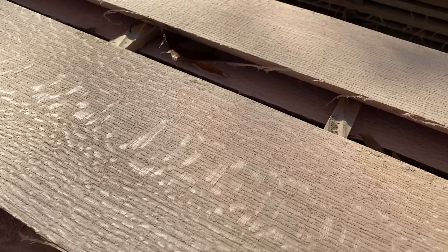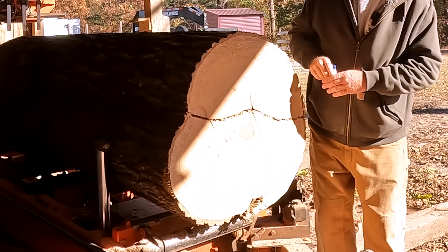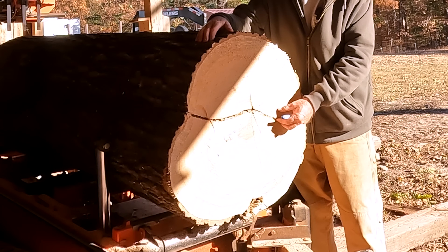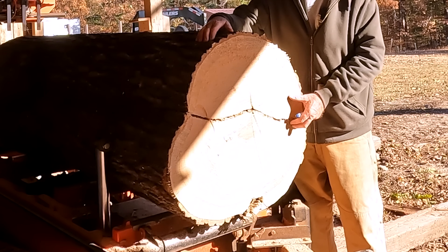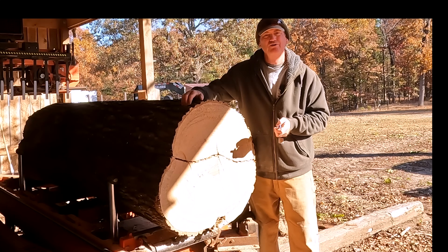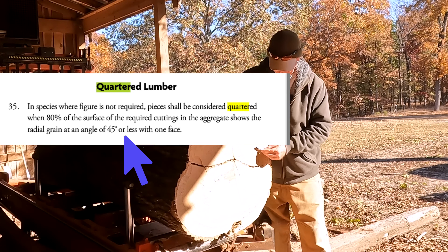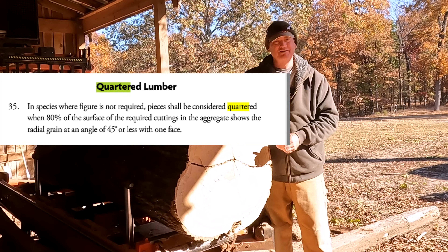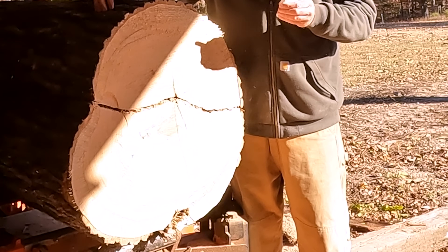Since the rays are waterproof, they have a certain reflectance or chatoyance whenever you're quarter sawing. The reason I want to do this log is because there's a fairly distinctive crack right here, and that crack is important when quarter sawing because that is the ideal direction your board should be oriented. In order to make quarter sawn wood, you need a specific angle relative to the growth rings, and in this case these cracks give you a perfect guide — Mother Nature's helping you out. If you follow the cracks, you're going to have quarter sawn wood.